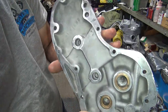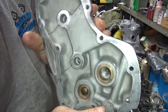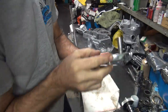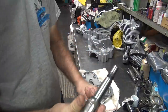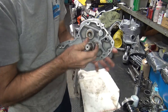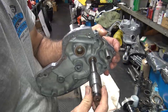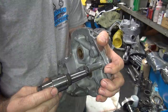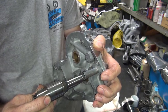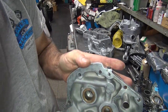First thing we're going to do is check our bushings out here and see how bad they look — how much metal is on the inside down here at the bottom where they rub. The bearing area actually works. You can see how this has some kind of a mark in there. Overall it doesn't look too bad. Now you take your shaft, put it in the hole and see how bad it really is. You can see how much clearance you have in it. Overall it's usable — a little loose, but it's usable.